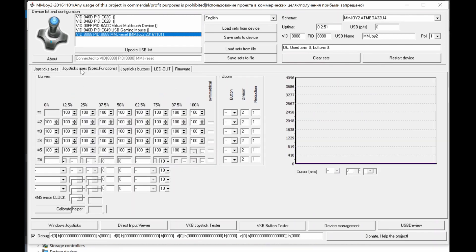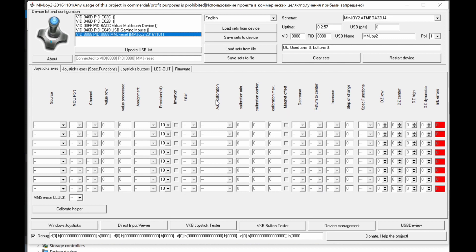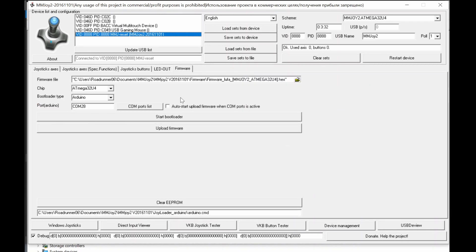The MMJoy firmware can also output LEDs using shift register functions to light up buttons or indicators, though I rarely use that. I mainly use the axis and button features, and use it for yokes and throttles I've created. You can also program response curves directly in the firmware, and auto-calibration runs each time you switch on your device — a useful feature guaranteeing it's always calibrated properly. We'll discuss all these features in Step 4.